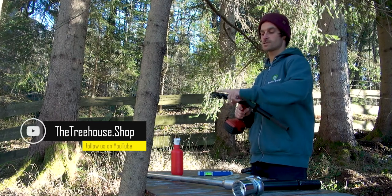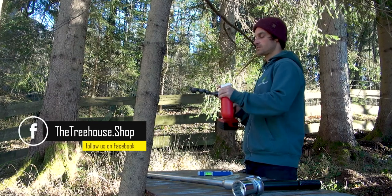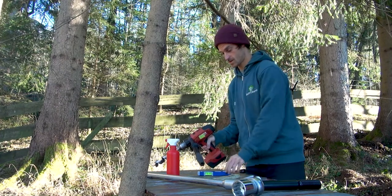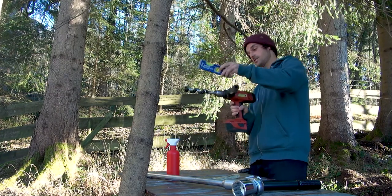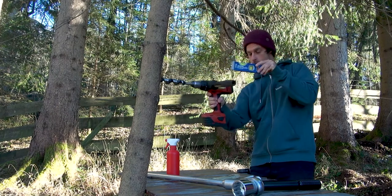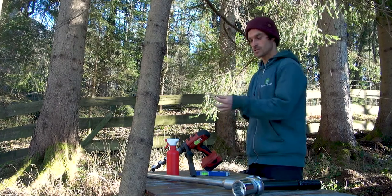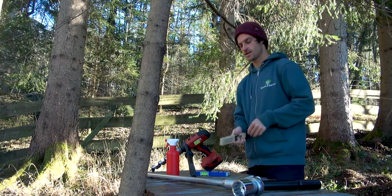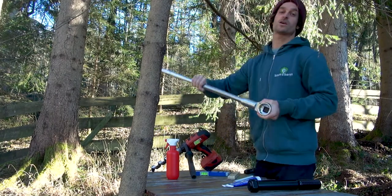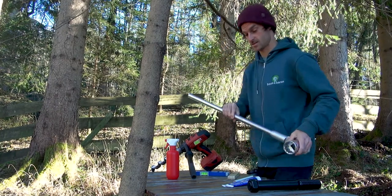You need the 36mm auger drill, something to disinfect the auger drill before starting to drill. Alcohol works. Then you need a torpedo level to get the right horizontality of the drill. Of course, you need a meter rule to measure the depth of the tree hole. And then to screw in the screw, you need a big ratchet again. Even with the small screw, it might get really hard.